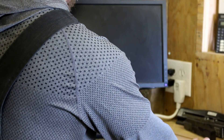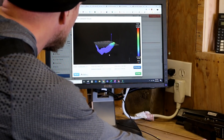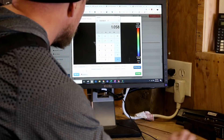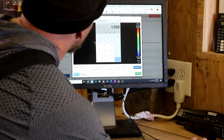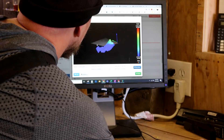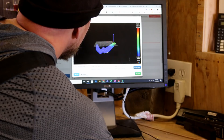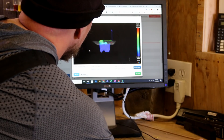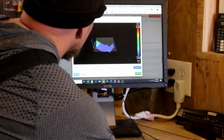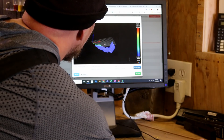Let's get started again - bed compensation algorithm, go! Oh, I think we just did it! Oh lord, that's so close - we are 58 thousandths of a millimeter off from being fine. We got that drop off again on the side here. We're making big progress though - that was a big jump. But that thing's all the way over, it's like over in the middle of the plate. You can't have that - that would be a bent plate.